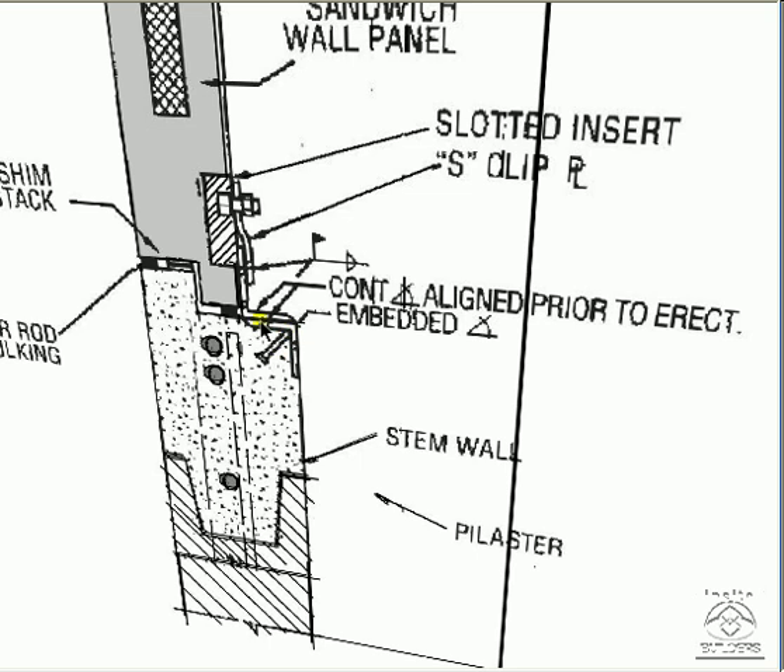Here's an angle embedded in that corner. This angle is welded to that angle. And then this precast panel sits on some shims and interlocks in this keyway onto this tie beam. As you can see, the tie beam is cast into the top of the masonry wall.